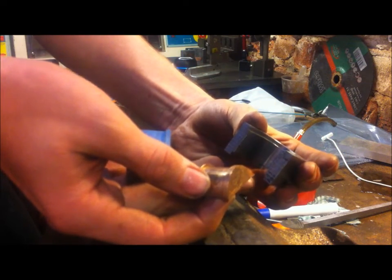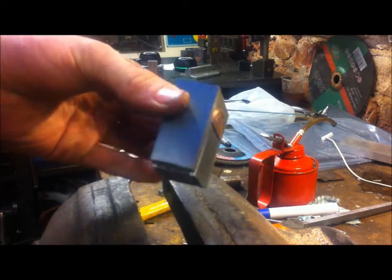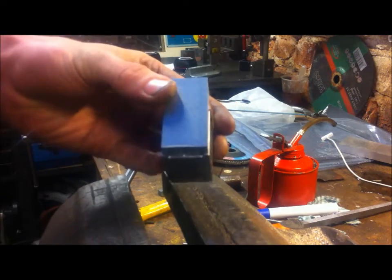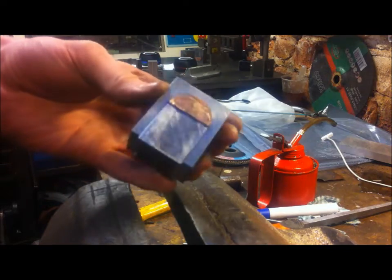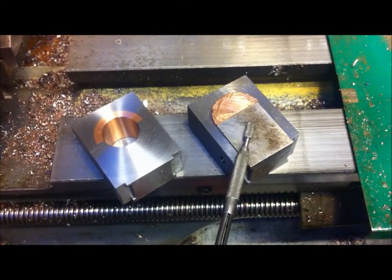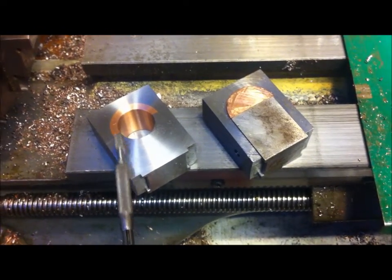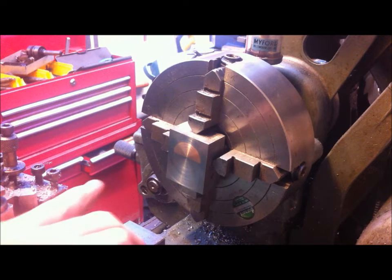Here is one assembly with the three bits together, ready to be machined on all faces and bored. I'm here at the Myford lathe and I am taking these components and facing and boring them. There we have all three components faced off and flush with each other. The next stage is to produce a hole down the middle that I can then get a boring bar into.